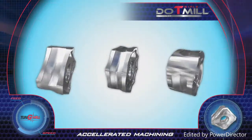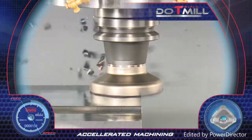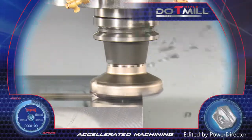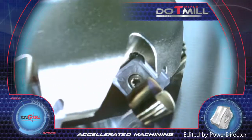One pocket can clamp three different insert geometries: square, octagon, and round. For larger depths of cut, the square insert with eight cutting edges provides the optimal choice. The insert features a concave shaped cutting edge which forms ideal shaped chips that evacuate easily.